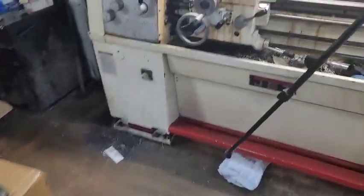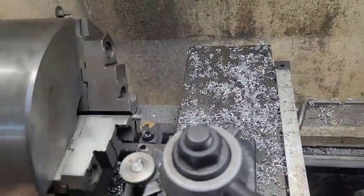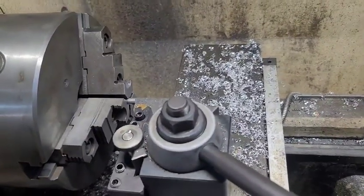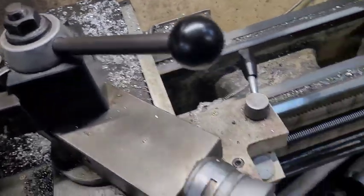I went and cut off an 8x1.25 bolt and put it in our precision bolt cutoff machine. If you don't have one of these you can use a hacksaw and a file. What we're gonna do is get that 8x1.25 bolt fitted in the hole, face off the end of the bolt, then drill and tap it to M5 by 0.8.